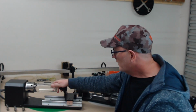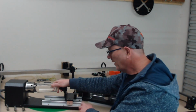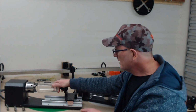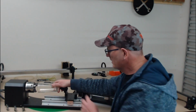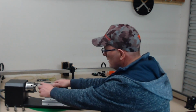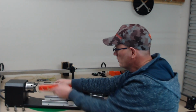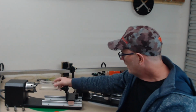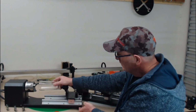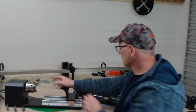So with the chuck rotary axis, as you can see, we could clamp that in on the jaws or hold it in place with our soft workpiece so that it doesn't damage it. But then it is always running on its central axis. You can't actually adjust for the slope of the glass unless you were to slightly move the back of the rotary attachment up until this was level. So this glass has a slight slope in it, so you would have to prop the back up until the top of the glass was level with the laser head so that it didn't go out of focus.